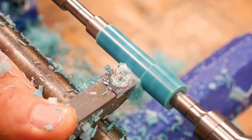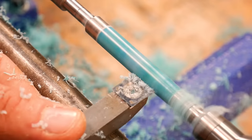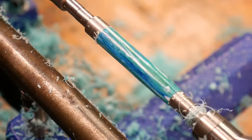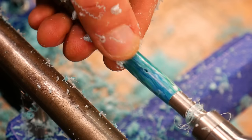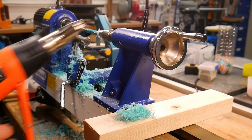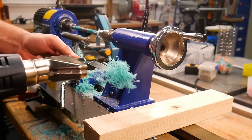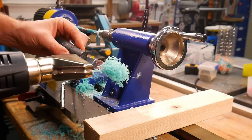If you've never used a lathe before it is really good fun and very satisfying. Just make sure you're wearing eye protection as you occasionally do get some pieces flying towards you. One thing to note is that because we haven't glued our tubes in, the plastic does catch on the tools slightly more often. This only really happens at the start as you're trying to get the blank into a cylindrical shape, so keep it slow and steady and keep that mandrel nice and tight. With our first blank we did find a couple of air bubbles as we got closer to our final shape.